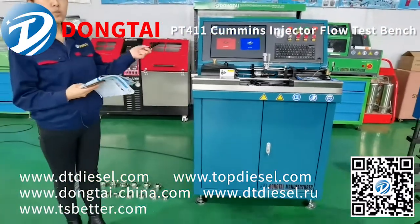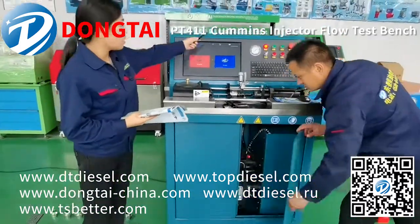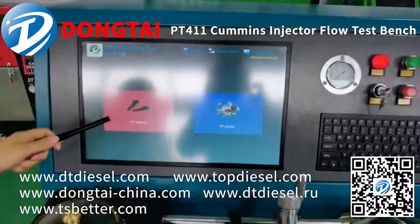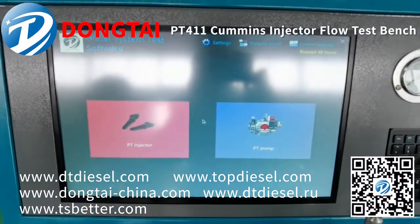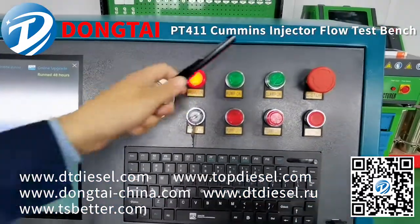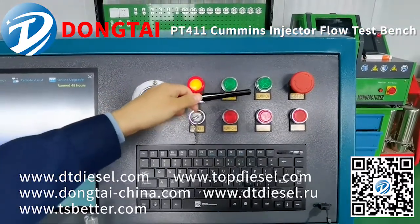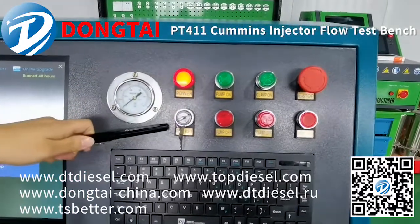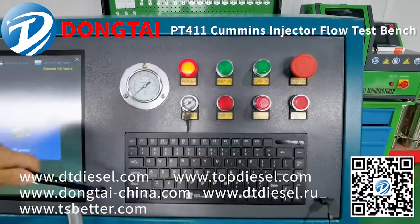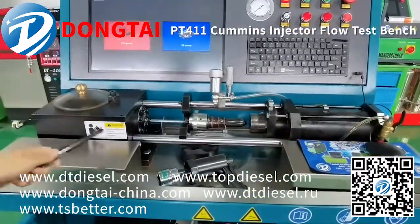Now let's see the details of the PT411 test bench. This is the system of this test bench, to test the PT411 Cummins injector. Let's move to this area. Pressure gauge, control button, power pump on button, clamping on button, emergency stop, power key, pump off switch, clamping off switch, heating switch, keyboard. This is the work area, cam box.